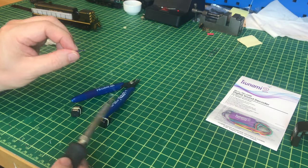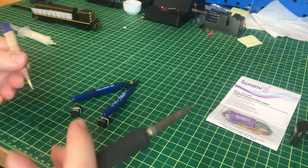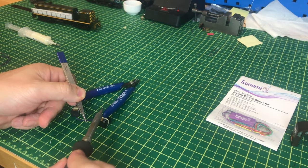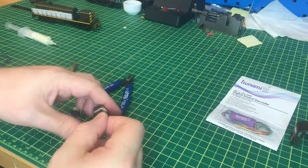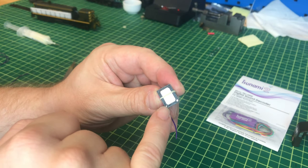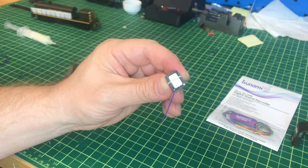We get a little more solder — you can use tweezers for more precise control. We line up our tinned wire end to the corner terminal, touch the soldering iron to the terminal, and the wire is soldered in place. We do a close inspection to make sure the solder is only on the small terminal and not touching the big magnet located nearby, because solder touching the magnet can potentially cause issues.